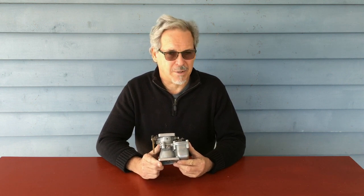Over years — decades even — times have changed. The most significant change is we've had a year's worth of testing on this, testing carburetors in the field and found out there are huge variations in the carburetors that builders are using on these. Some of these variations are very, very significant to the operation of the aircraft. These variations can cause detonation, and that's unacceptable.